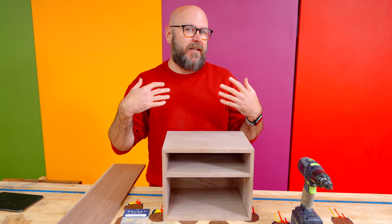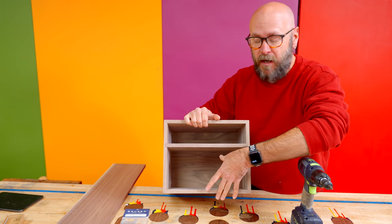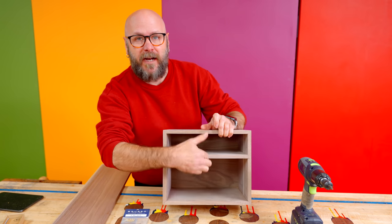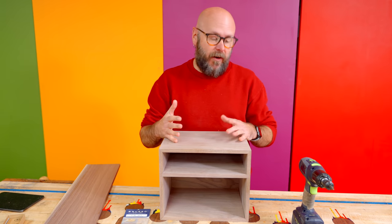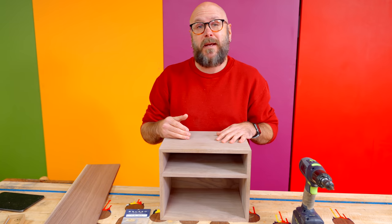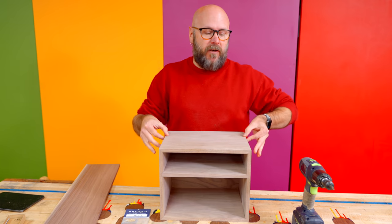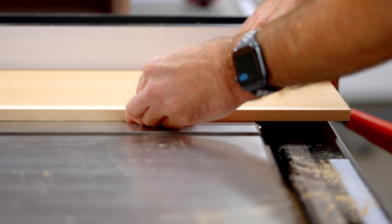And so to make this a little bit more fun, I'm going to make this one big drawer that has a hidden compartment in there. It's gonna make the project that much more fun. And plus I might do a little divider down the middle of that big drawer to make it look like two doors. I always love being open to calling an audible when a project needs it. And I think it's gonna make this project a lot more fun. So one little drawer and one big drawer, and they're both going to use the same mitered corners and a plywood bottom as the outside carcass. So let's go cut those up.